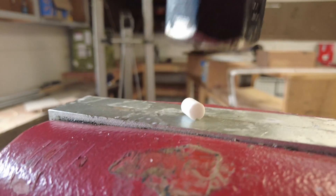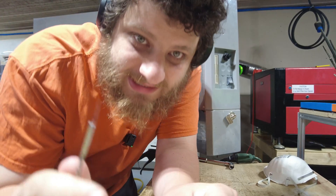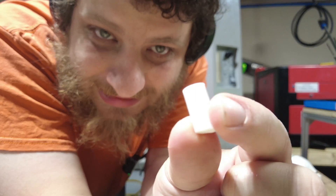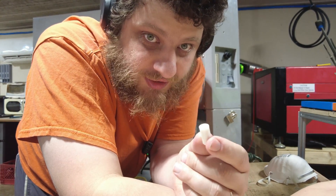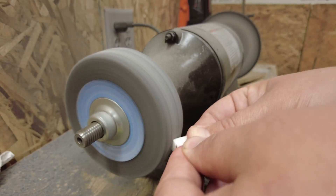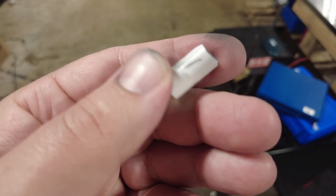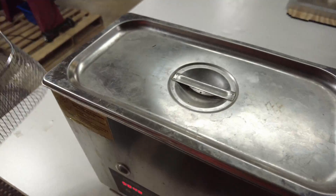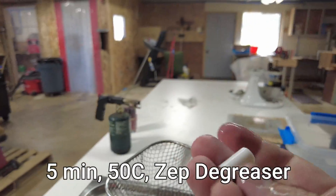The parts are made, but I want to do some experiments with this material to get an idea of its mechanical properties in case I need to use it again. I took this job solely to experiment with it. How well does it handle impact? That was better than I thought — yep, there you go, that wasn't even that hard. How does it handle sharp things? I'm actually removing material with just this, so in terms of hardness this stuff is not hard. What does it do on a Scotch-Brite wheel? It gets rid of it pretty quick. Can we polish it? It definitely polished. How does it handle the ultrasonic cleaner? It's absolutely fine as you would imagine.